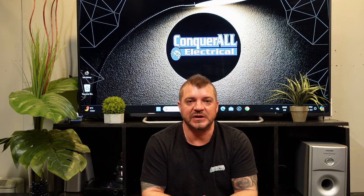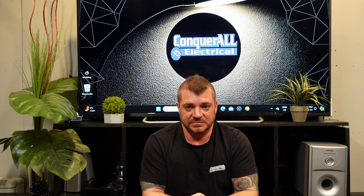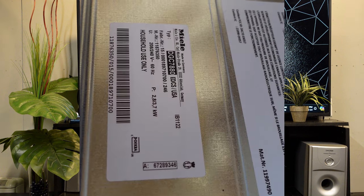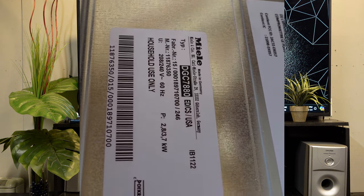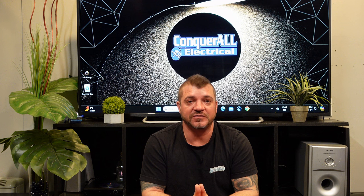Most people will go to change out their new ovens and cooktops, and some of them have dual ovens that can draw far more than 7,200 watts. So be very wary and careful of that when replacing. Even if it's the same size, it's a good idea to check with your electrician. We get customers that purchase a new oven and we can't hook it up because the wiring is too small, and we have to run a whole new complete wire.